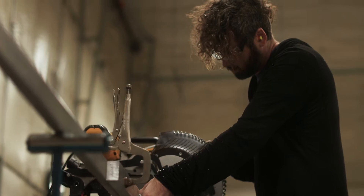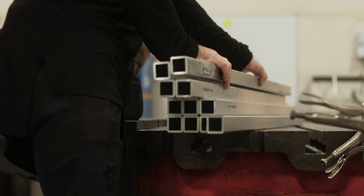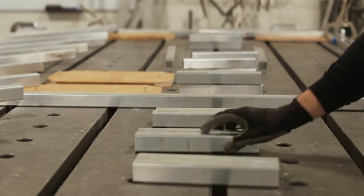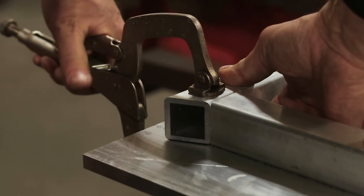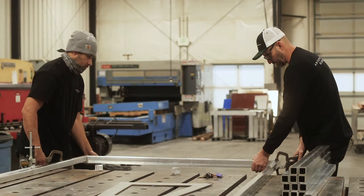When you're working in technology, a lot of times you're working with your mind and not your hands, so this is bringing back some old-school skills from my farm boy days. We're going to take our various pieces, lay them on the table, fit them up together, float this corner here, use a temporary piece, and do some light clamping to make sure everything's secure and not wandering — then tack weld for speed.